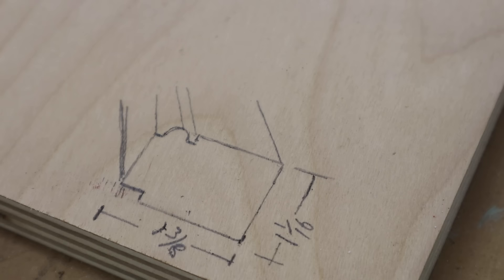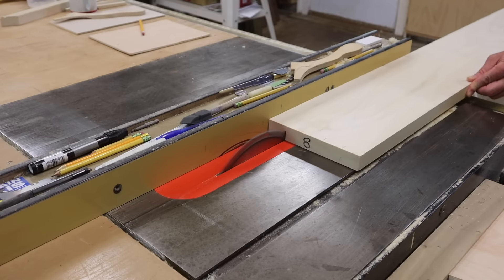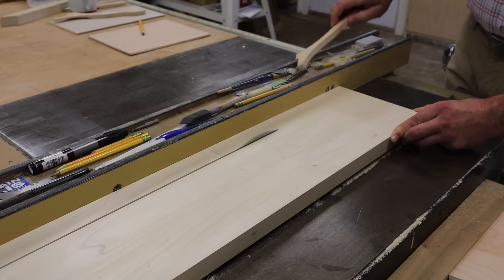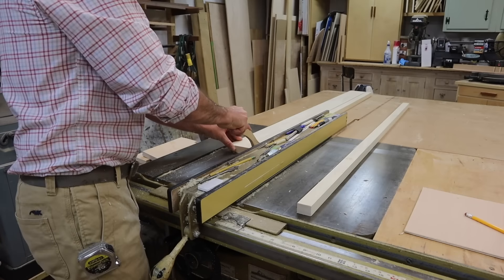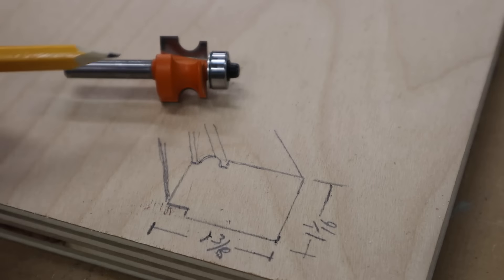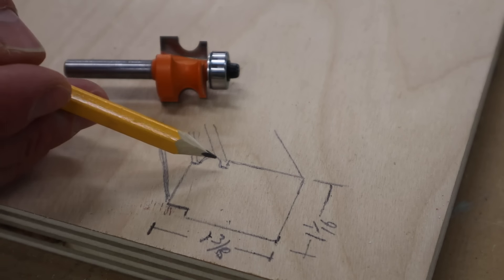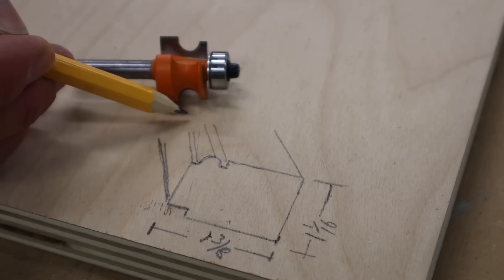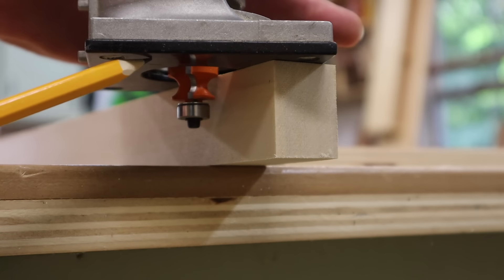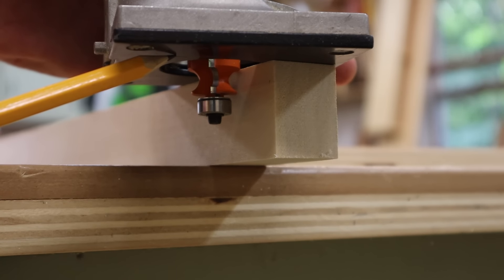This is the first piece of molding I'm going to make, and I'll get started by ripping the board at an inch and three-eighths. This is called a corner beading router bit, and I'll use this bit to add a bead profile on the inside of the frame. Before running the router down the length of the board, I'll test it on the edge to make sure I'm at the correct height.